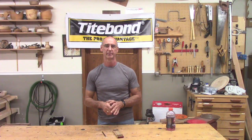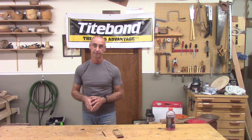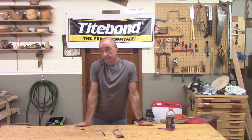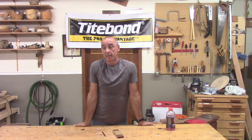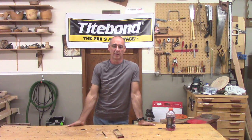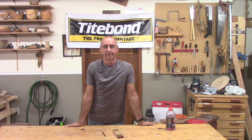Okay. Mike asks, George, I am setting up my first wood shop in my basement. Most of my tools are benchtop with a full-size saw stop and full-size jointer. Does it make sense to put everything on mobile stands? Yes. My shop is 3,600 square feet, and everything in here is on casters. So it's just, you change your mind, you want to move stuff around, you get some task in there that's bigger than anything else you've done before, so you got to just push some tools against the wall. Casters are your best friend.